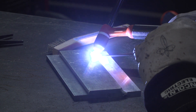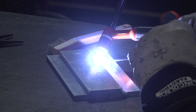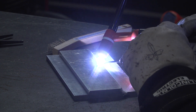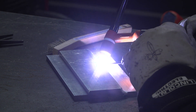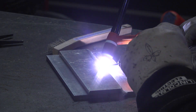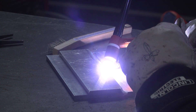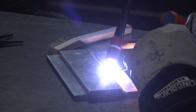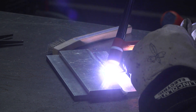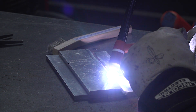I'm trying to maintain a proper angle. Now we're beginning to saturate this aluminum with heat. This is what it takes — it only takes 1,200 degrees to melt this material, but that surface oxide right in the middle is getting burnt off pretty well. When you look at the edges you'll see all of the oxides kind of melted there. That's normal — it's a normal part of welding this.